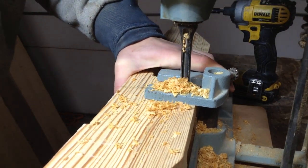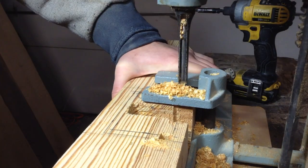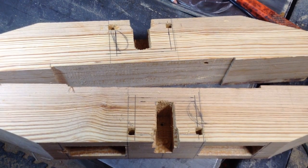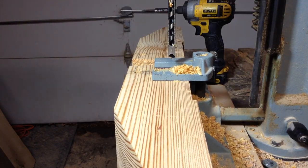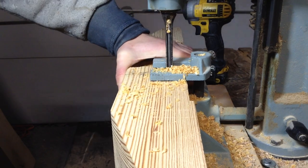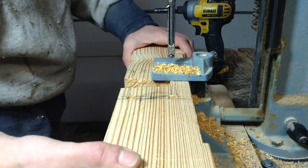There are different opinions about stretchers and aprons on tables. I usually recommend both. I will make stuff without stretchers, but in general I won't make tables without aprons. I've told people if they want tables without aprons, I will make it, but then they can't call me when the table fails over time. They're there for a reason.